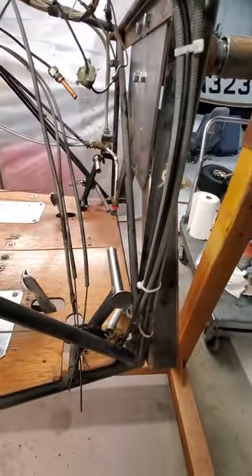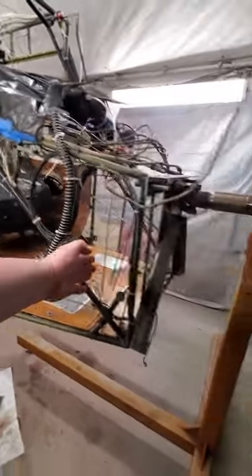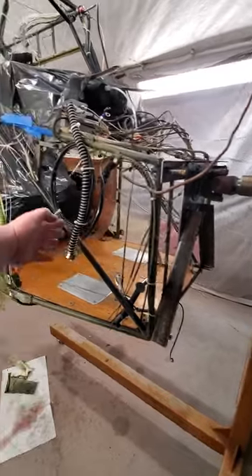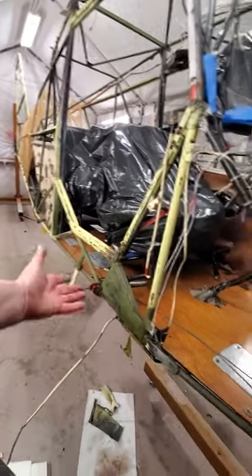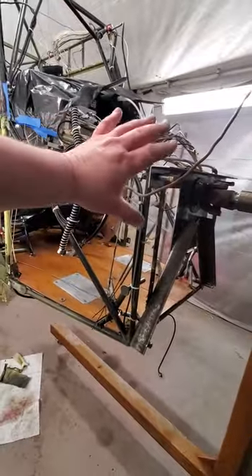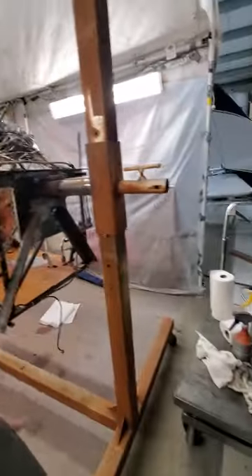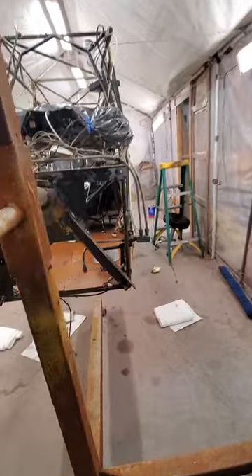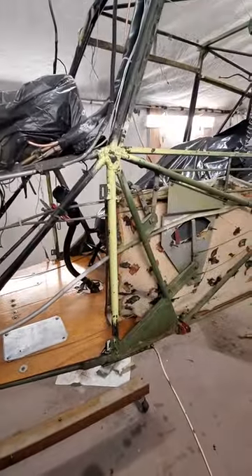You can see it's right to the structure of the fuselage. Right here is the boot cowl — that's a metal piece, so there's no fabric here. From here backwards up to the tail, that'll all be fabric, and of course on the belly as well. This whole section right behind the firewall is just a metal piece called the boot cowl.